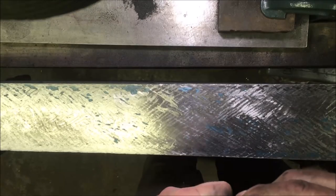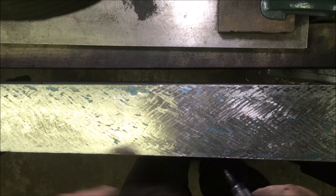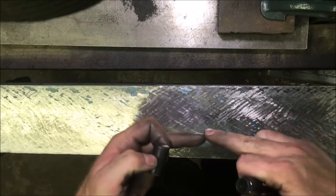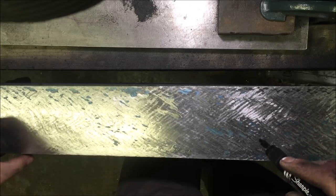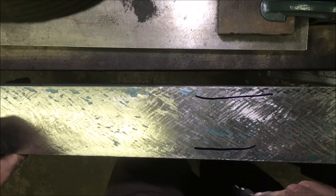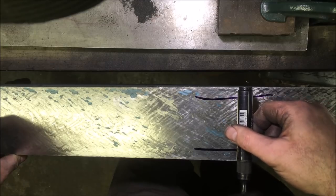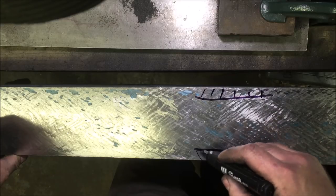Alright, so here's the scenario. This is the 6 foot by 4 inch wide straight edge. On cleaning the rust off and the initial print, it shows it's pretty level along its length. There's a slight fade off at the far corner where the rust was deeper, but it's printing heavily down either side. I then stuck on I think it's about 10 inch by 3 inch straight edge across the width and verified that, yeah, it's printing like that.